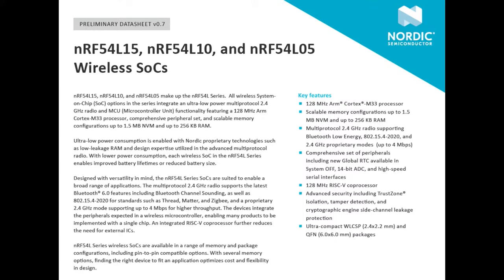There are actually two variants: the NRF54L and the NRF54H. We'll talk about the H later, but the L is what's being announced right now. It's a new Cortex M33, 128 MHz processor with BLE support, lots of NVM re-RAM — which we'll talk about later — peripherals, ADC, and more.